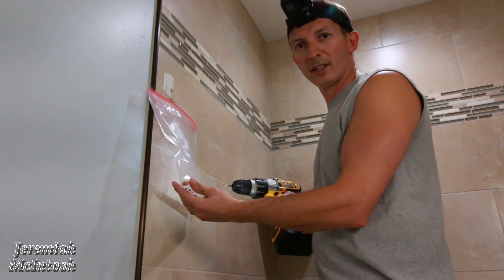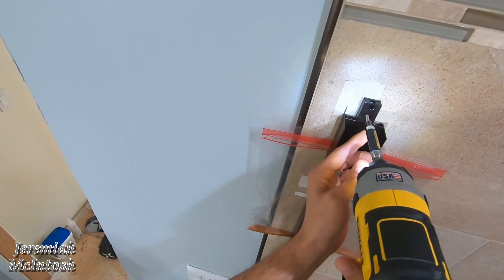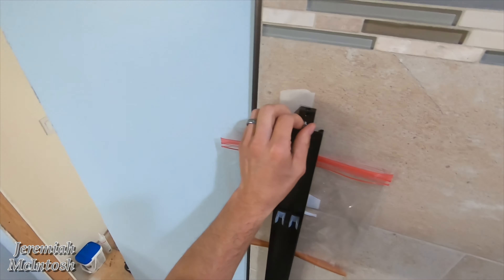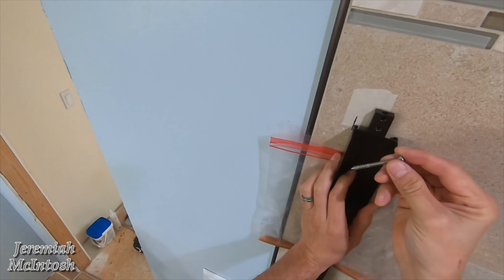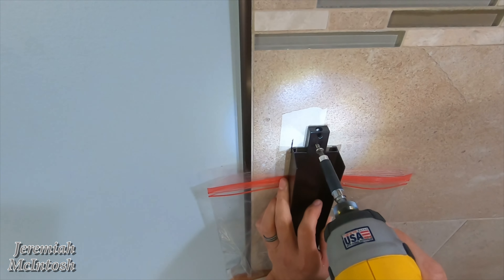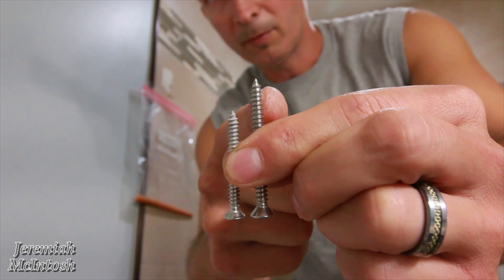We're through the tile and into the cement board. The little bag caught everything from going onto the floor. Now, they give you inch-and-a-half screws, but I have half-inch cement board behind the porcelain tile — with these screws they just won't grab anything, they pull right out. They do give you anchors, but I have a nailing block behind my cement board, so I bought two-inch stainless steel screws from Lowe's instead. They're one size thicker and they grab the stud nicely — nice and tight.